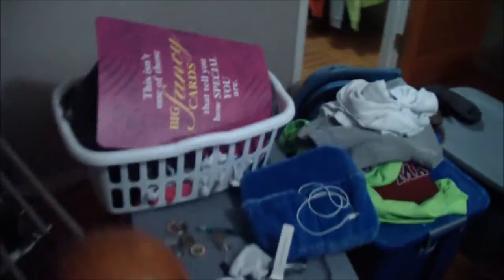Master bedroom — got a fan down this wall, a dehumidifier, another fan, another fan there. One fan in the master bath underneath the vanity, and one fan back here in the master walk-in closet. This parquet floor — we'll see if it dries. We'll make a determination on what we're going to do with the parquet floor later. You can see it's really water damaged, a lot of spots.